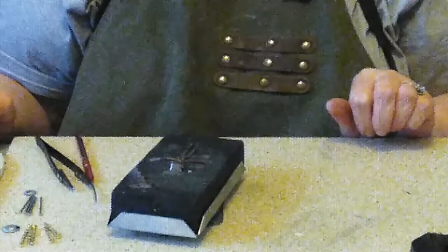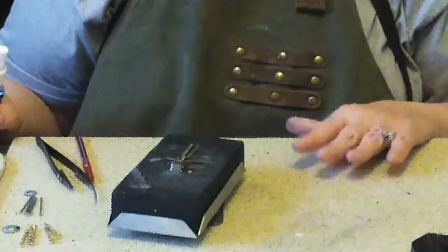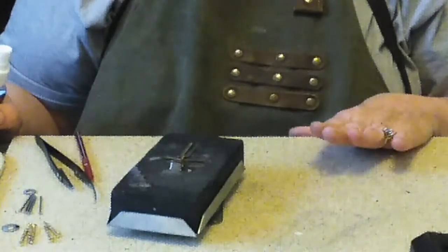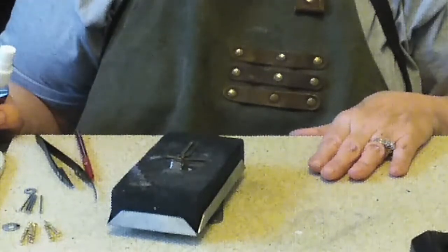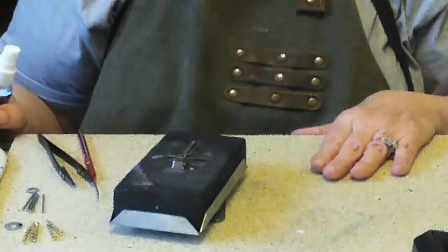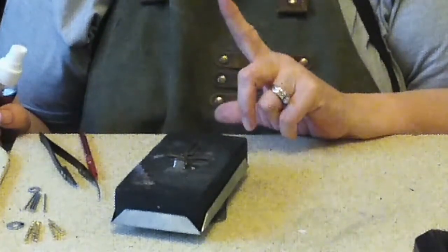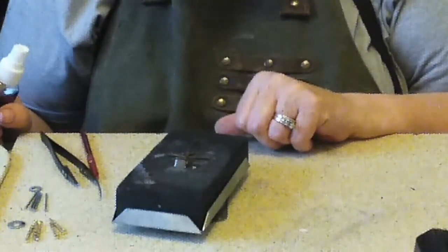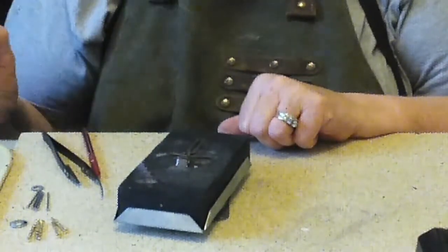All right, we're back to the drawing board. I've kind of taken the pieces from the first figure that I was trying to do and set it aside, because now that it's got fire scale, it's going to have to be cleaned up before I try soldering it again. I will try soldering that after I get it cleaned up. Now with some of this other solder that I have, I'm going to try soldering this tiny piece. The solder that I'm using now does not have a core, does not have flux, and so I'm going to use a liquid flux to put on here.